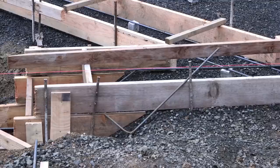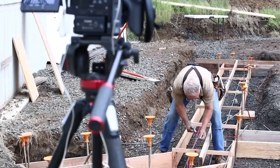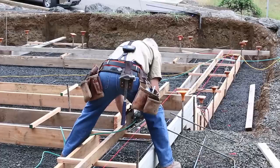It's not a bad idea to call the mason and say you're getting ready to pour these footings and ask him to come check the layout, or maybe offer him 50 bucks to put the layout on so nobody — especially him — is unhappy once it's in place. Odds are he'll say he wants it right and will come lay it out while you tie it in. Maybe your general contractor can make that happen. However it works for you, make sure — double sure — that your template is right and your rebar verts are in the right place.